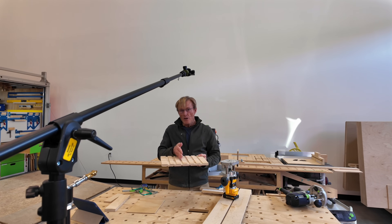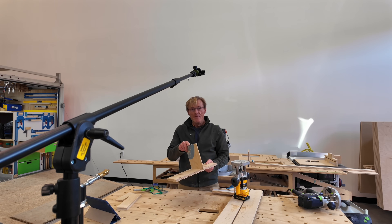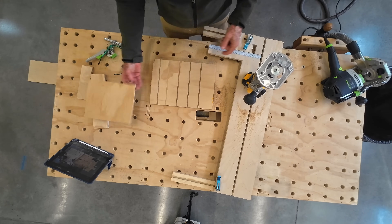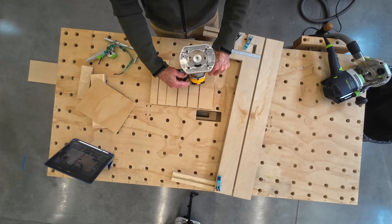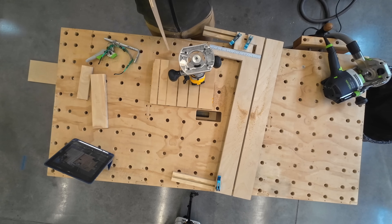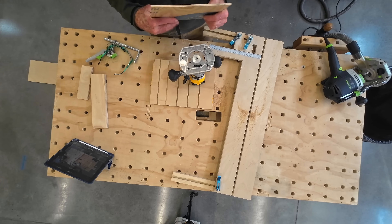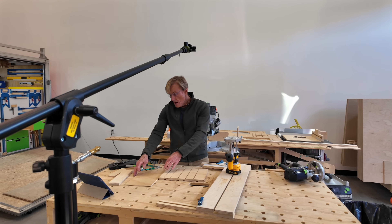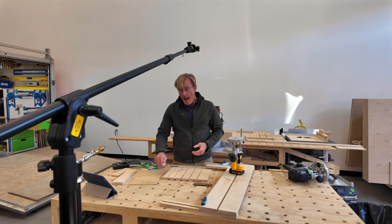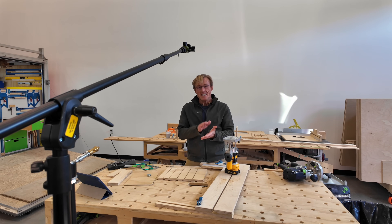These dados you saw were absolutely tight for that furniture finish. These I wanted a little sloppy because they have to slide in and out. The way I achieved that — after just sort of setting this up loosely, I didn't push it tight — I used a quarter inch bit and a three-eighths inch bushing. A quarter inch bit is slightly wider than this material, so there's no way I could have made it tight with this bit, and that gives me exactly what I need. If I wanted a tight dado for this material, I would drop down to a five-sixteenths bushing and a three-sixteenths bit, and then make it in two passes for that absolutely perfect tight cut.